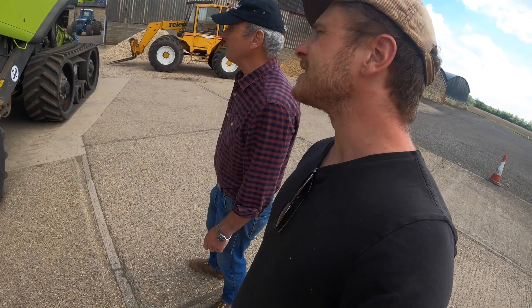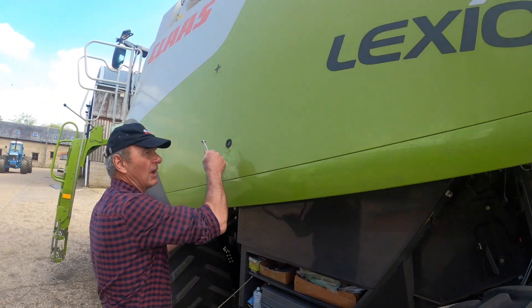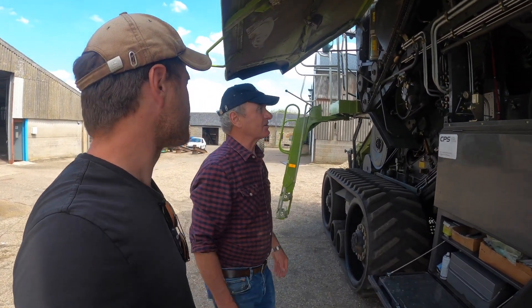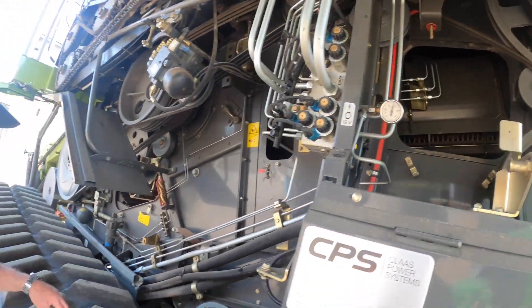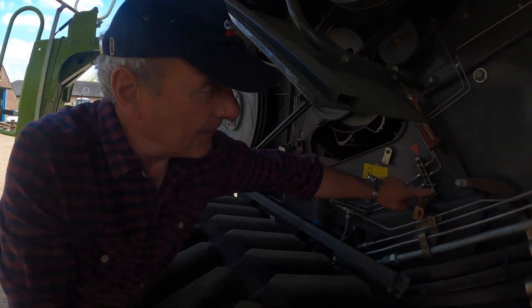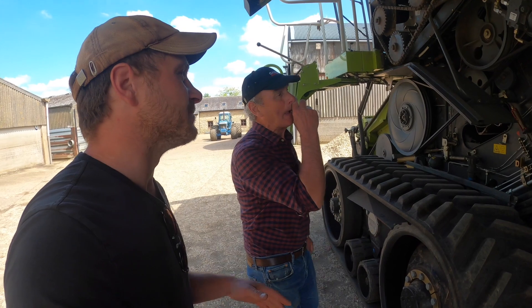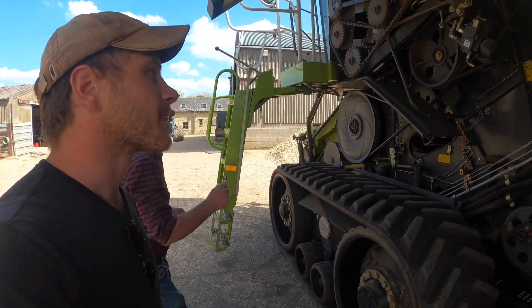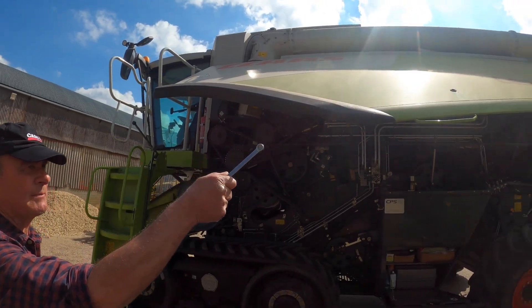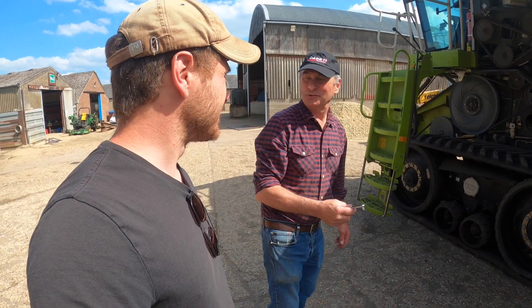Fairly easy to maintain, Nick. It's the cleaning down after harvest that's the hard bit — I'm meant to go greasing service points throughout harvest. We don't wash our combine — we just blow it down. We did wash it just pre-harvest, but normally we just blow it down rather than power wash it. Two rotors — being a hybrid combine, you've got a drum at the front. We've actually got an accelerator in the main drum and then the two rotors. We've got various banks of greasing points — but there are some trickier ones. Normally we set aside a whole day before harvest and go right through it. The auger is a good point — you've got to get the auger in a certain position, knuckle joints. Camera on the auger, and a camera at the rear of the combine — the one on the auger is really good for tipping the trailer when unloading.